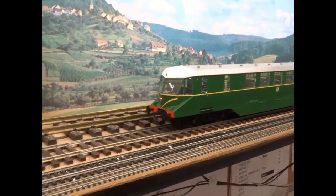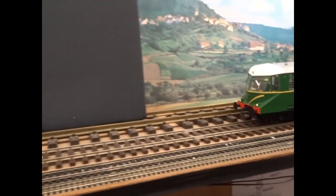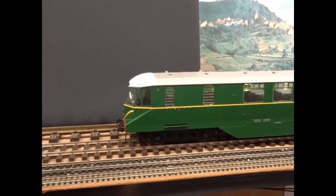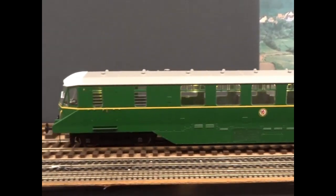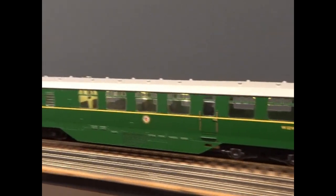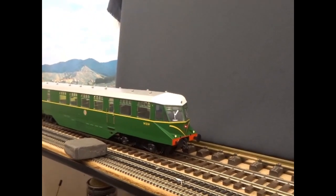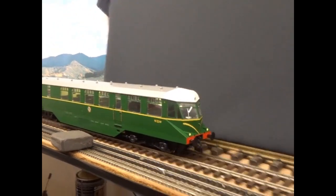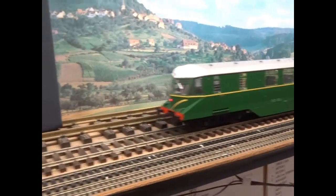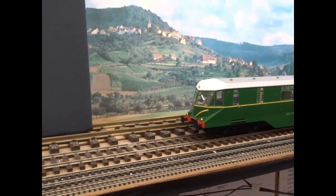I've left the acceleration fairly sensible but I've put a couple of features in — there is a half speed shunting mode on Function 3 which just cuts the speed in half. Function 6 turns off the acceleration delays, so it drives straight off the throttle — they call it direct drive. With Function 6 off, it uses the acceleration delays so it will have a bit more inertia.